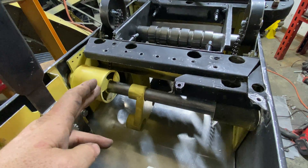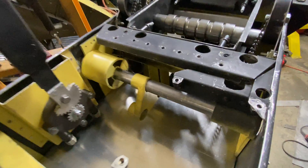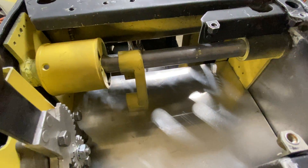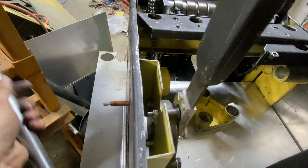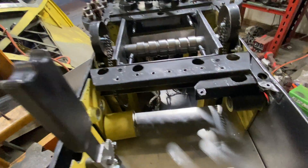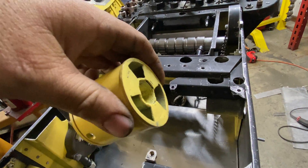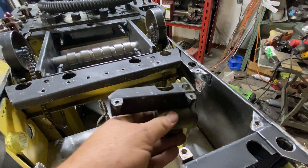About 98% of the stuff is made by Convair, but a few things like these are made by government subcontractors. I try to get as many subcontractor parts in here for relevant size. I made my drum, which accepts 3/32-inch control cable. That comes out, and you've got your idler mount and your drum. I still need to put an additional hole in there for the taper pin that retains this to the torque tube.